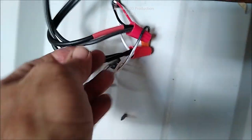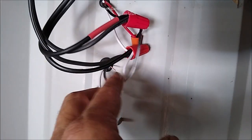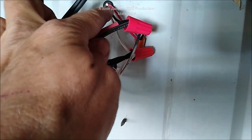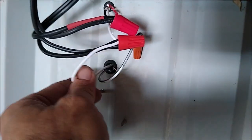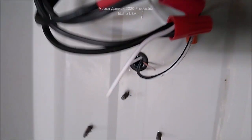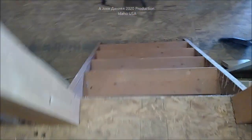Back up here on the second floor. Power coming in is marked. It has another line going further down for the other light. The black wire from the light fixture goes up to the red load wire on the controller — that's the load. The black wire from the controller goes to 12-volt DC positive. The white wire from both the controller and the light fixture goes to ground. You can snip off the small ground wire since it's DC — low voltage, nothing to worry about.